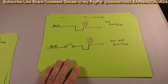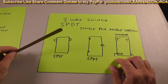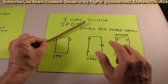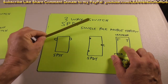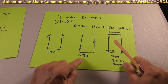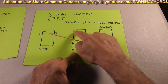Now let's talk about other switches. We're getting to the three-way switch in a minute. We have the single pole, single throw, which means this is the pole and this is the throw inside the switch. When you turn the light off, it's like this. When you turn it on, it connects. That's the SPST. They also have an SPDT, which is a single pole double throw. This is the common.